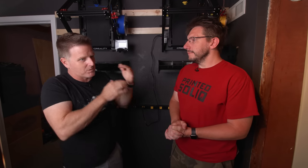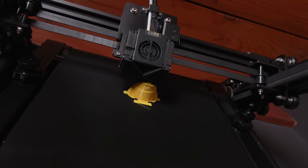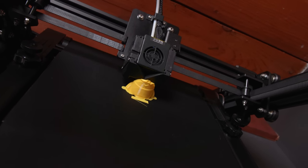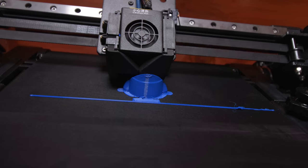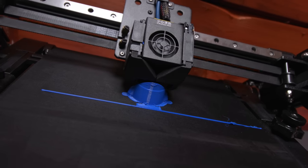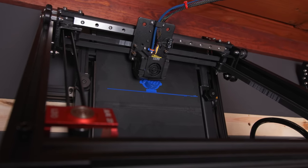It did. When we were doing our calibration, you could see it was starting to stick better once we got that finish from the manufacturer off. You seem to think it could be a function of the manufacturing process that leaves a finish that just needs to be taken off, whether through scrubbing with isopropyl alcohol or just printing a number of revolutions until it's gone? Yeah, I really do, and that's what we've seen in our experience with it.